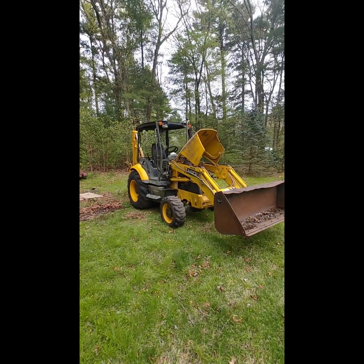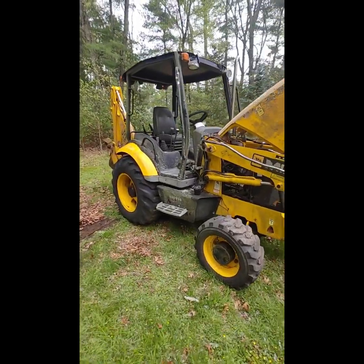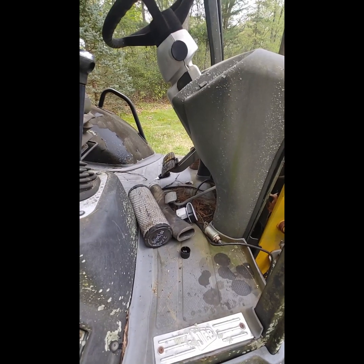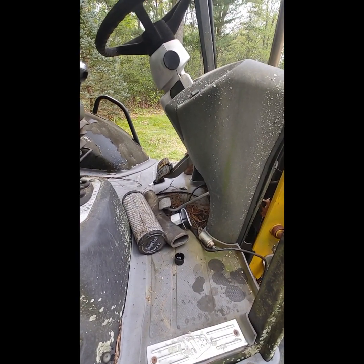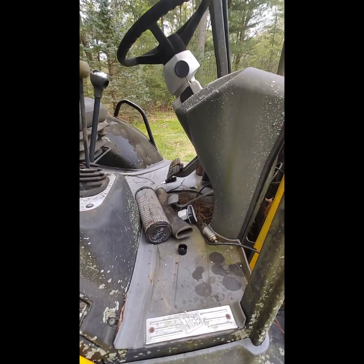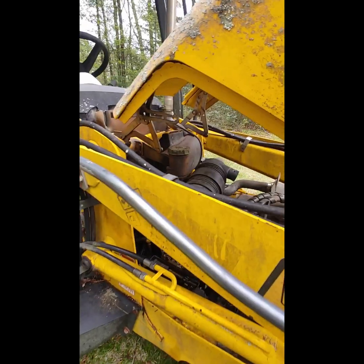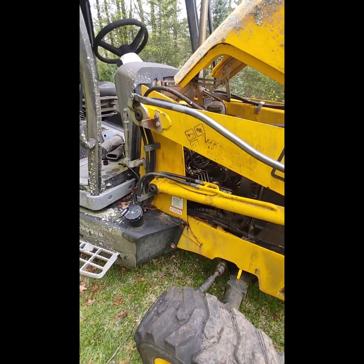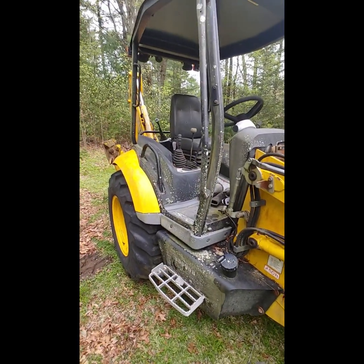There's also something seriously wrong with the brakes. The pedals feel like they won't depress at all, but it did roll and move no problem with the parking brake off, so at least they're not stuck on. And there's a brake reservoir right there, so this tells me it's supposed to be power brakes. But all the hydraulics were working. That was good. Nice.